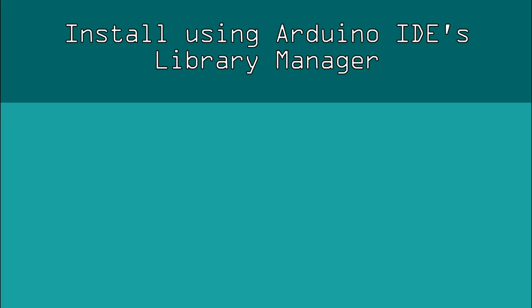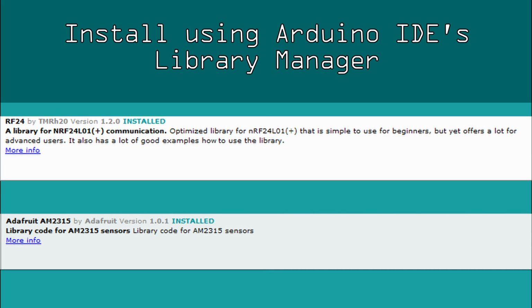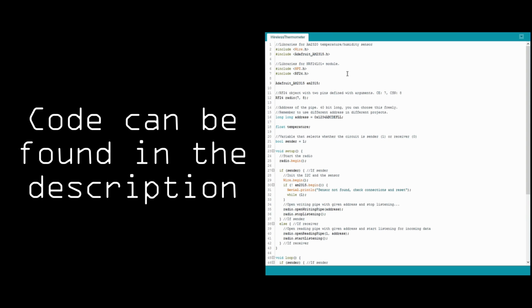On the software side, there are two libraries that need to be installed for this project using the library manager of the Arduino IDE. The first one is RF24, which is a great library for using NRF modules with Arduino. Another library is Adafruit's AM2315, which is compatible with this AM2320 temperature sensor. The code, which you can find in the description, should be quite straightforward. I've added comments which will be helpful, and the RF24 API reference can be found in the description.